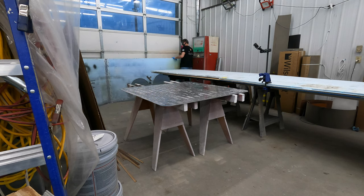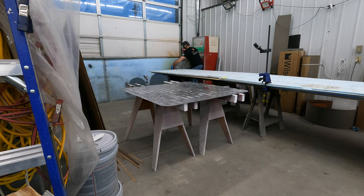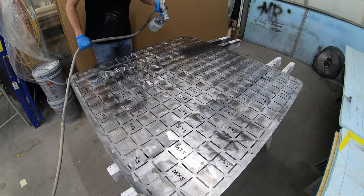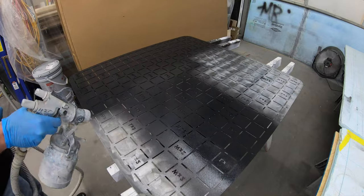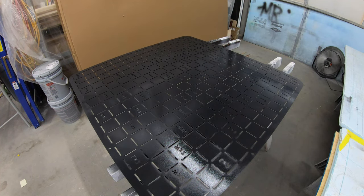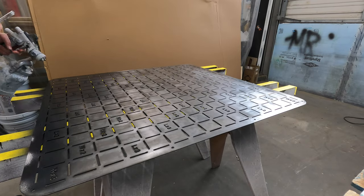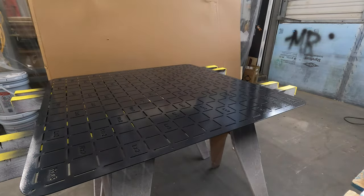There it is finished after a lot of sweat. Here I'm getting my paint booth set up — I should do a whole video about all the things I don't have, including a good paint booth. I have styrofoam cut for the fans — it pulls negative pressure and gets the fumes out. I'm painting the back first. It's not pure black, more like charcoal. The back almost had a polished look before painting because the plasma cutter creates a slag that hangs underneath and has to be ground off. In the end the black made the roughness disappear — you really had to look to notice the letters weren't perfectly cut.